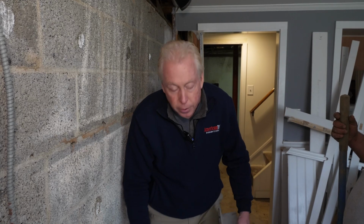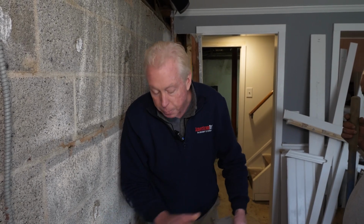Okay, so I'm going to dig down and show you where our drainage is, and then you're going to understand where we put our drainage, the water can't get anywhere near the bottom of the floor, let alone have the entire floor sit in water. Concrete's porous, it absorbs that water, so you constantly have a damp floor. We eliminate that from ever being a possibility tenfold when you see where our drainage is.